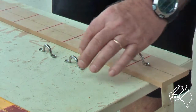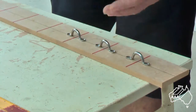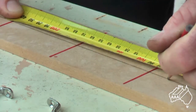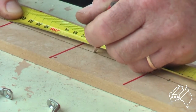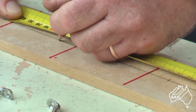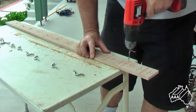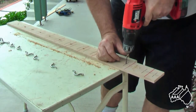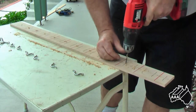After marking the 80mm centres you will need to place the saddles ready for drilling them out. In this case the hole centres are 20mm either side of the wire centres.